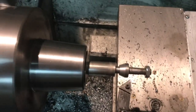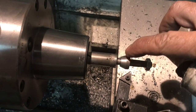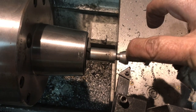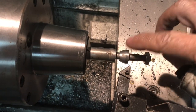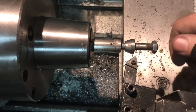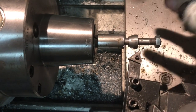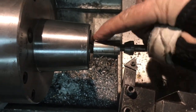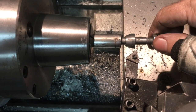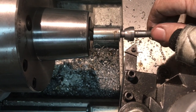I'll put the power off on the lathe and take a look. I'll put a file on that just to take the little raised edge off - it's good to go. I forgot I left the nut on here, but it's handy - I put it on so I could pull out without too much stick-out pressure on the steel. It's a trick I learned making valves for the locomotive: just do one segment at a time.